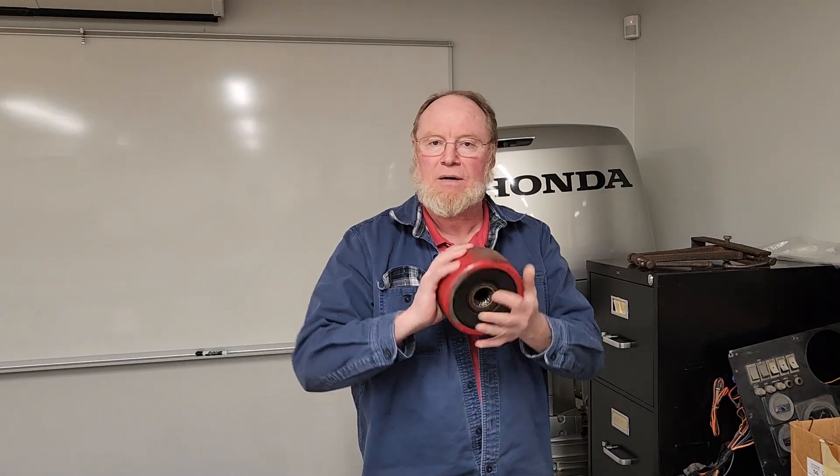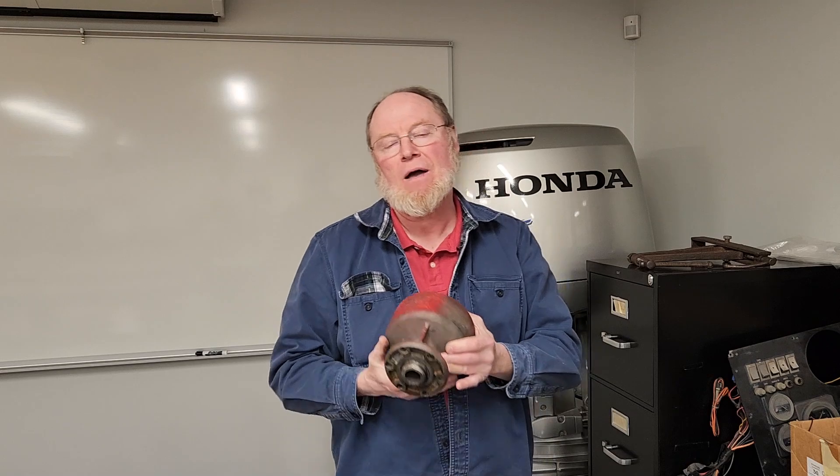So that's the video for today going over engine couplers and the importance of engine alignment. Every single time I take a stern drive off and go to put it back on, I always put an alignment tool through the transom assembly and check the engine alignment. If it's not correct, I'll go inside the boat and make the adjustment so that the drive coupler is perfectly aligned with the gimbal bearing — that's what the alignment tool does. You can buy an alignment tool; they're not super expensive, but as a private boat owner you probably don't need one — you should have a dealer check it. Certified shops should have drive alignment tools for Mercury, MercCruiser, and Volvo stern drives. If you liked the video, hit that like and subscribe button and I'll see you in the next one.